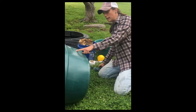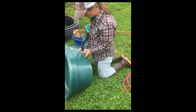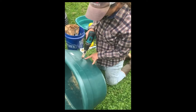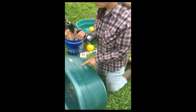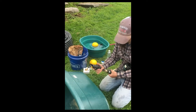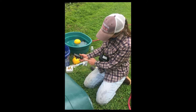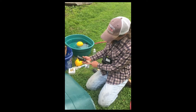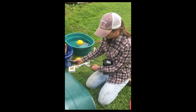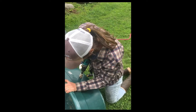I'm going to drill my hole — this float has a label on it right here with numbers so you can make sure you center it on your tank. I'm going to put it in right here. I'm using a hole saw and I already measured this to make sure the hole is going to be slightly bigger than the threads that go in, but not a huge amount bigger because it has to seal. Go ahead and drill your hole.